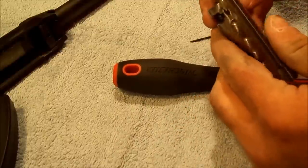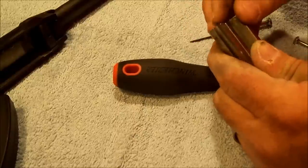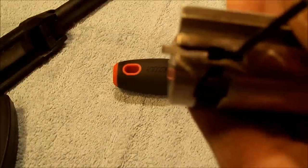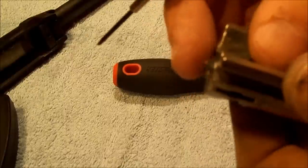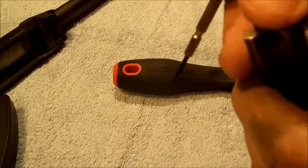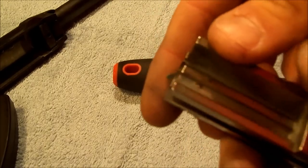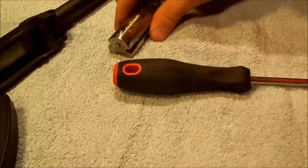Our extractor is under spring tension now. If you can see it, the plunger is right there pushing against the extractor. You can see that we've got a nice good hook on the extractor, and it's sticking out properly on the bolt. So that should engage our .22 long rifle. As you can see, we did do some jeweling on there — makes it look a little fancy.